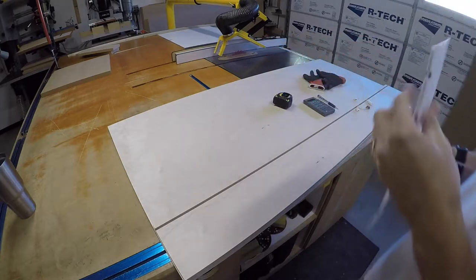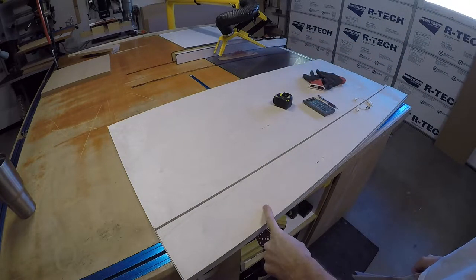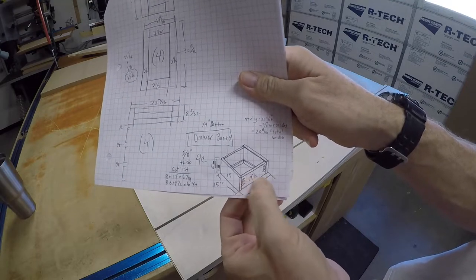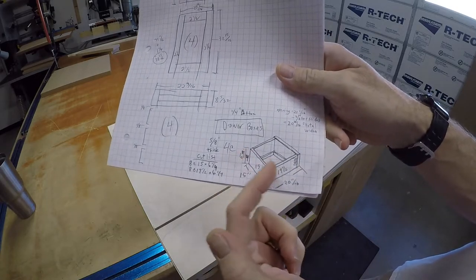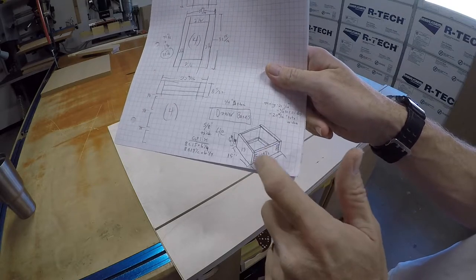All right, I'm gonna make some drawers. These are gonna be Baltic birch, 5/8 inch thick. And we're gonna be doing this kind of joinery with it. So rather than doing dovetails or anything else, we're gonna be doing pocket screws. There's gonna be a drawer front on the front, so that's gonna leave a clean side. And these boxes are gonna be painted, I believe.